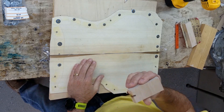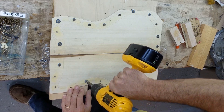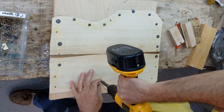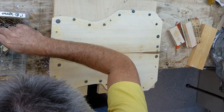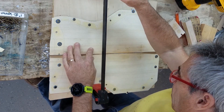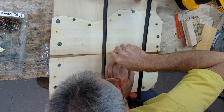I didn't have the camera very well positioned, so I'm going to switch to a second spruce top to show this next part. On this one I have a walnut accent running down the middle — again, that's optional. Here I'm lining up the two halves and pushing them hard together, tightening a screw at either end to hold it down tight. Now I'm using this simple tool — just a block of wood with a slot cut in it — to check that the two sides are at the same level all the way along the center. If one side is a little higher you can simply press it down. With the two halves lined up, I'm now going to screw the second half down. I tighten down the screw and then just back off about an eighth of a turn, just enough to allow the washer to turn freely — that's going to keep the side flat but allow it to slide as I clamp it. Carry on screwing down all around the periphery and then finally clamp it using two long clamps. Do a final check to make sure the two sides are lined up.